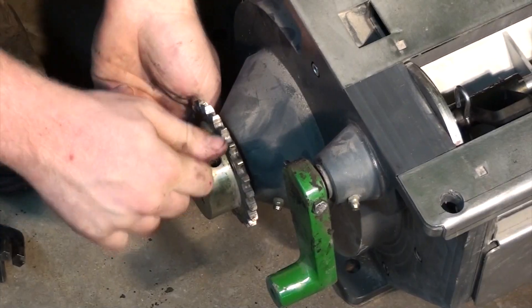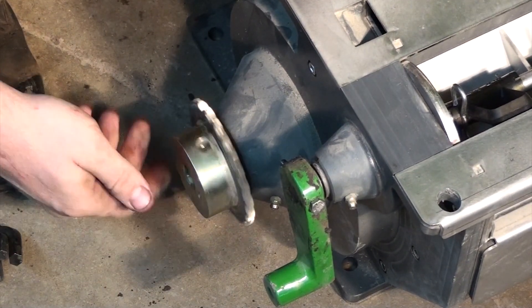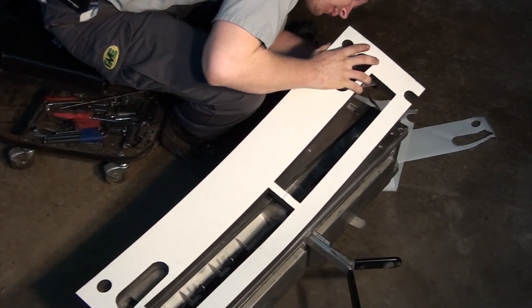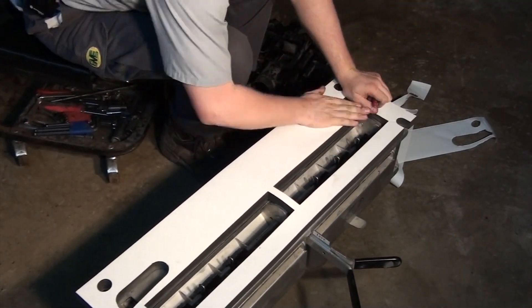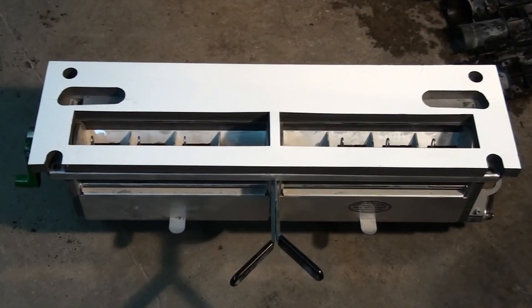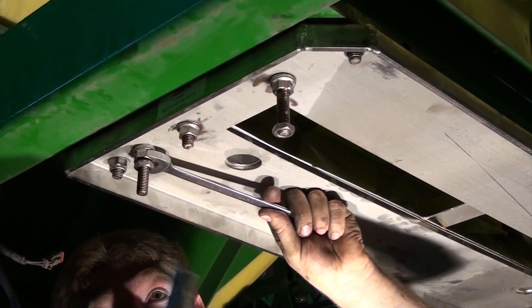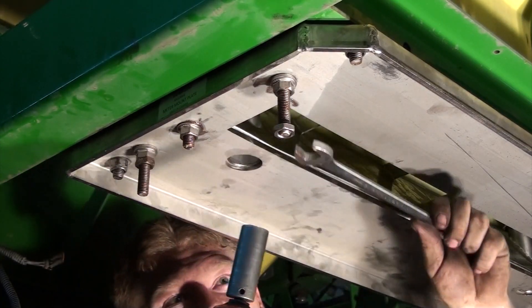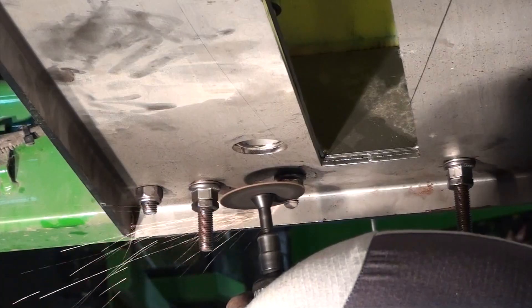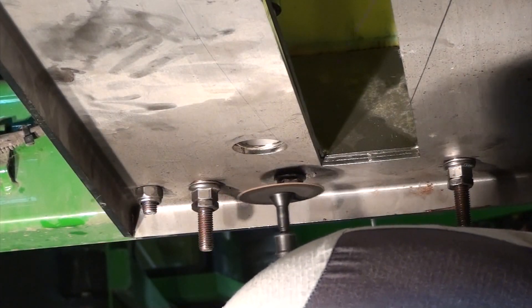No washer is required between the high density plastic housing and the gear sprocket. The sprocket should spin freely. Position and adhere the 1 inch foam gasket on the top of the meter housing. Do not remove the adhesive backing on the upper side. Now we will install spacer nuts as shown in order to provide proper space for the foam gasket. If the two bolts from the ladder bracket shoot extend beyond these spacers, cut them off.